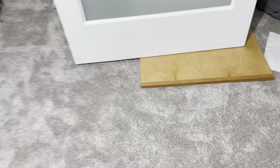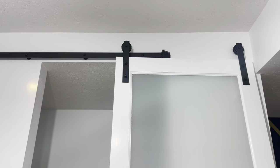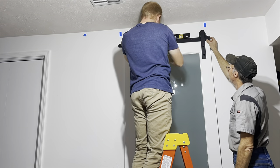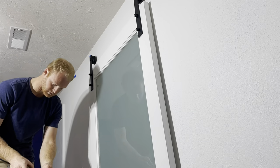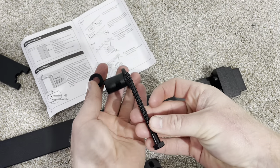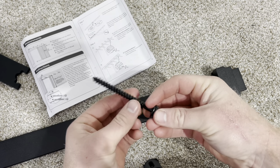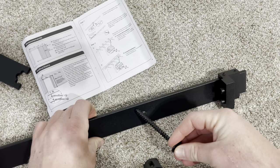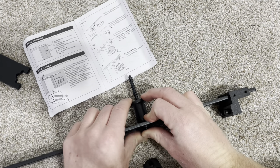Here's a little trick to help figure out the spacing for the rails on the wall: I used a piece of 3/4 inch plywood and set the door on top. Then I measured out the spot for the rails, and I knew I'd have that gap on the bottom once everything was installed and the plywood was removed. I had to bring my dad in for some extra hands during the install of the rails. We marked the spots for the bolts and checked for level. Next I drilled some pilot holes for the lag screw using a 1/4 inch drill bit. Now that we have the holes drilled in the wall, we take the lag bolt, put the washer on, lag bolt through the bar, and then the spacer on the back with the big part against the wall.